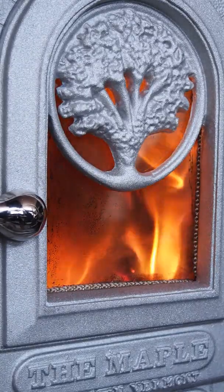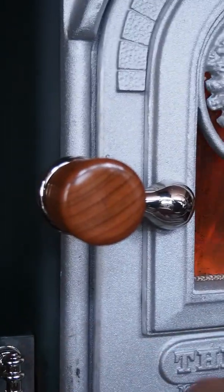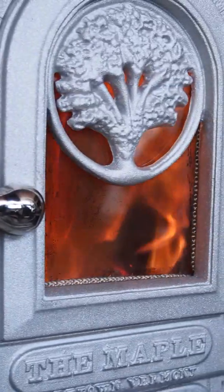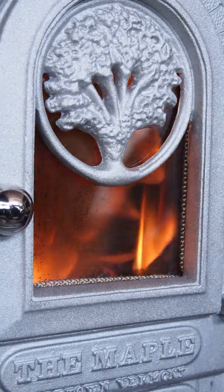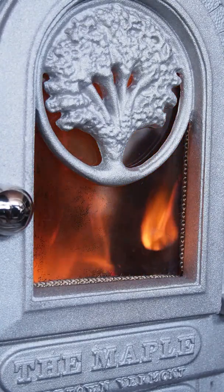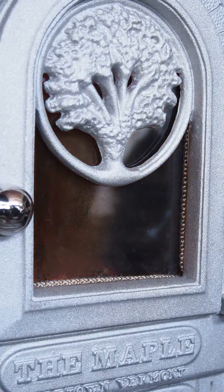by two 1-inch pipes in the lower left corner, lower right corner, and they're a U-shaped piece, basically meeting with a horizontal piece across the top near the front of the stove. And I guess the way that you can tell that this is secondary flame activity is that they seem to be floating around as opposed to coming up from the logs.